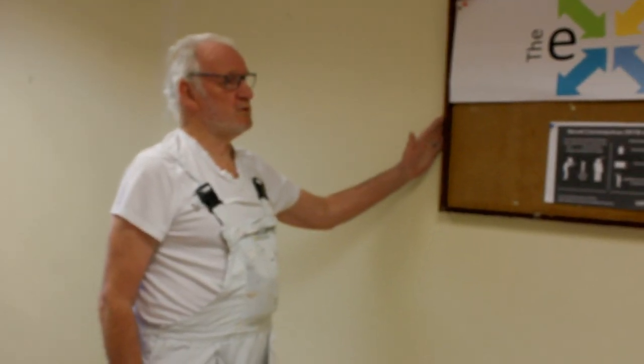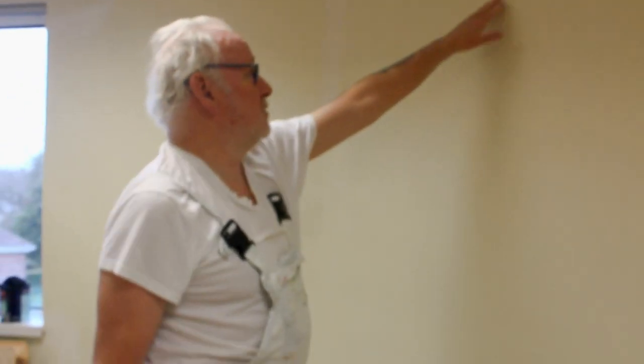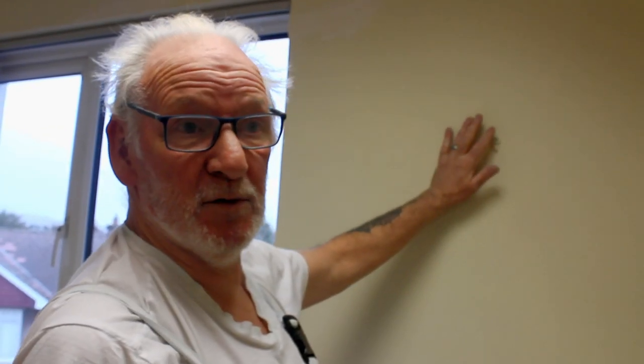Right, when we're starting to do the walls, remove any kind of posters or paintings or wall hangings. This one is fixed so we just leave this on, but anything else take it away and remove it. If there's blue tack or cellotape on the wall, make sure you get rid of the residue. And like up here we've got some nails, some wee fixings — these will be used again, but otherwise just take them out, fill them up, sand them off and prepare the wall.